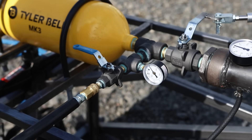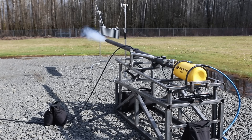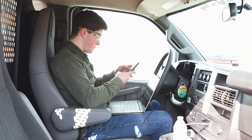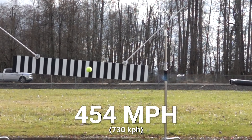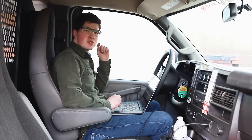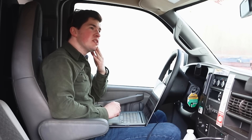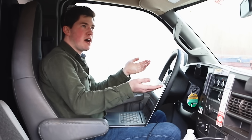After a whole day of shooting Mark 3 up to 1,200 psi I ran out of nitrogen. When I did the math I found that the ball only shot 454 miles an hour. So even at 1,200 psi it's still not faster than Mark 2. That really shows the trade-offs between low pressure high flow and high pressure low flow. I realized that even if I pumped a huge amount of pressure behind the ball it wouldn't matter if I didn't have enough flow.